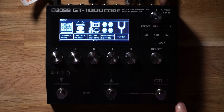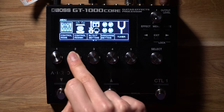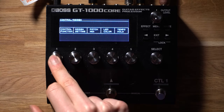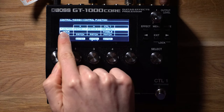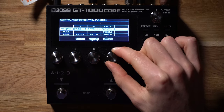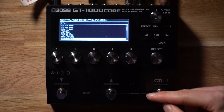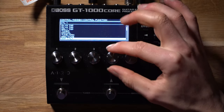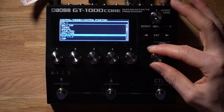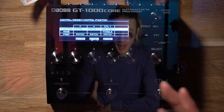If your channel switch control isn't working correctly, check one final setting: dive into Control Assign, go into Control Function, and check the function for Control One. Click the fourth button to enter that menu and scroll through to change the functionality and assign on control pedal one. Make sure it's selected to be Amp Control One, and that will allow you to do the channel switching on your amplifier as demonstrated.